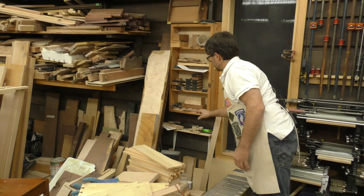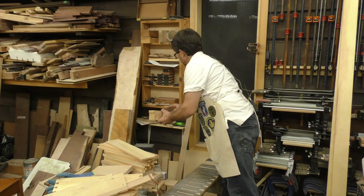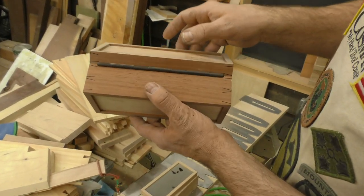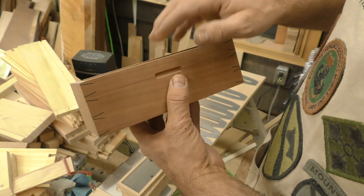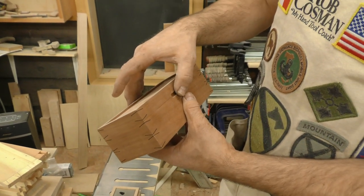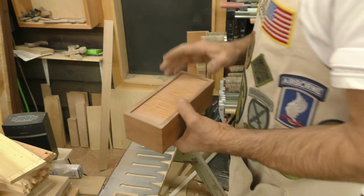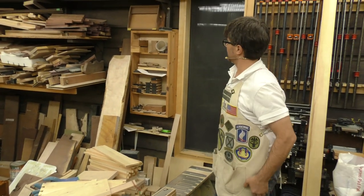On this particular box, the actual hinge will sit on the outside. Here's one where I left the hinge on the outside instead of flushing it off on the back. The idea was to take the exact same wood, cut it in three pieces — the middle piece stays attached to the top, two little pieces stay on the bottom — and when you close it, it all goes back together again. I've done them before so I know it works, just a matter of getting time to do it.